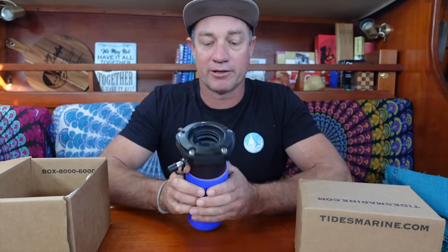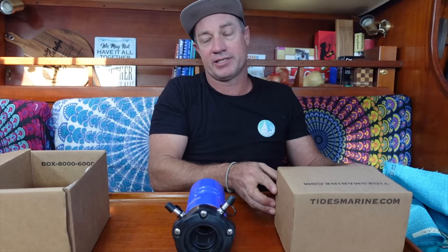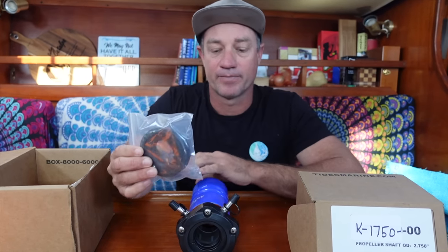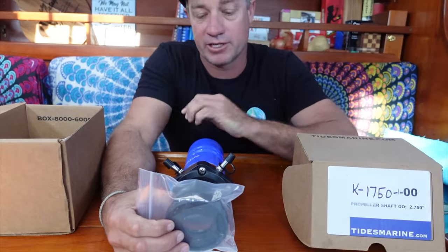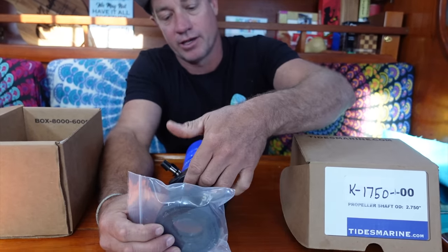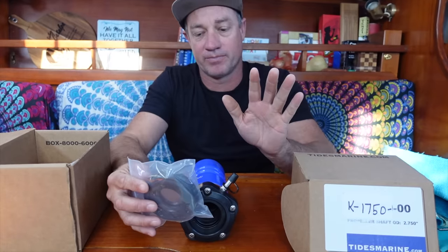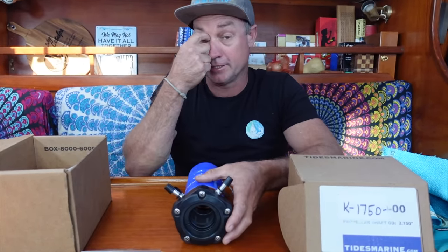There are a few reasons why I'm going for this seal. We all love redundancy in anything we have on a vessel. So if for some reason this seal were to fail, this is where the spare seal comes into play. This is actually just a carrier housing — it will be carried on the shaft in front of our lip seal. If this seal was to fail, we could unscrew this, remove the old seal, and slide down a new one. Job done without hauling, without any fuss.